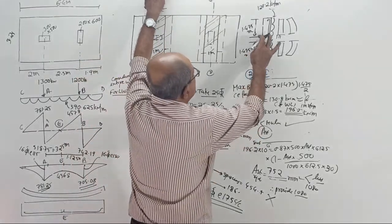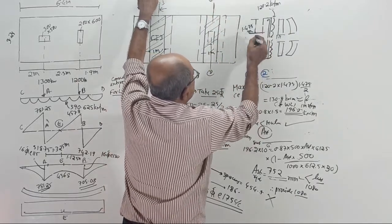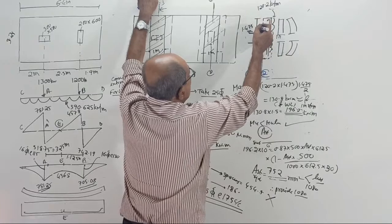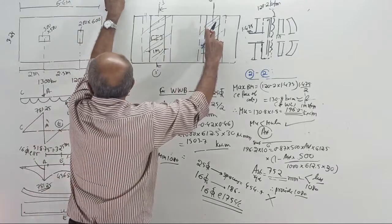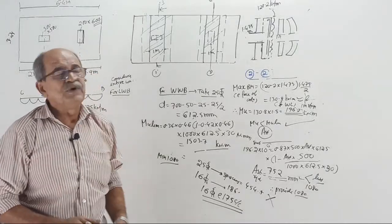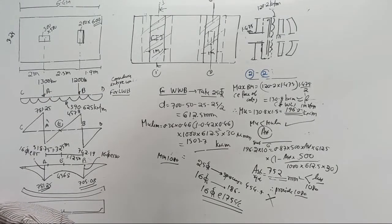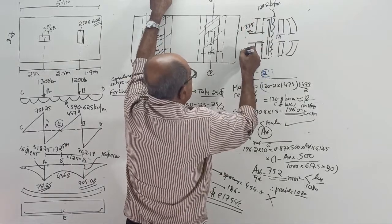Section 2-2 means, now you can see the column, see, you cut here, then you can see column side, now 500. Now tell what is the answer here, fast. You see, now you are seeing column side of 500, then 3.25 minus 0.5, not 500, sorry, 600. 3.25 minus 0.6 divided by 2, projection. How much projection? 3.25 minus 0.6 divided by 2 comes to 1.375 meter.